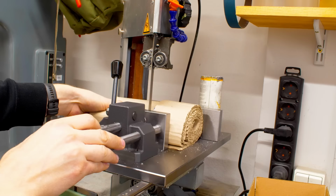You notice that when I cut them off, there is a little bit of material left here. That's because I didn't support the carbide on both ends, and since it's very brittle, it tends to snap off on the last bit of material. It doesn't matter here, because these are way oversized anyways, but for the wire EDM it would be nice if the ends are flat, otherwise this could mess with the water flushing that needs to happen during wire EDM. There is a stream of water running down, or it's completely submerged in a bath, which is what my buddy usually runs, but I was told it helps if the parts are flat on both sides.